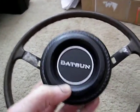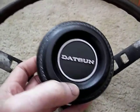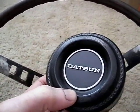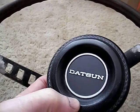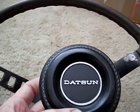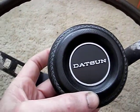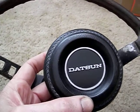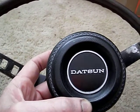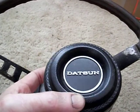What I took to finish it was: I stripped off the half that I'd already done, re-smoothed out all those corrosion pits using that tool that kind of knocked them down, then used some sandpaper and carefully smoothed the surface out a little bit better. About three coats of gray primer, sanded that, then some satin black.